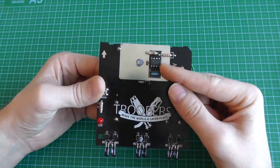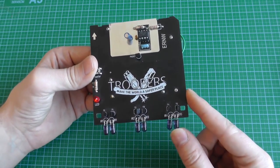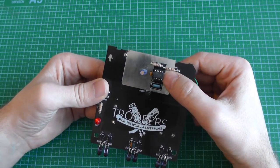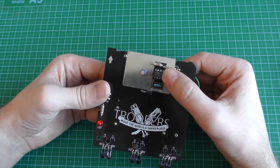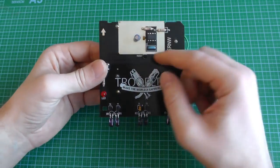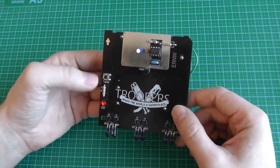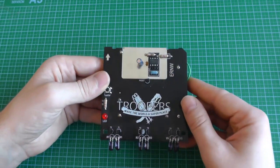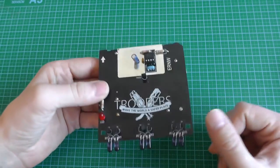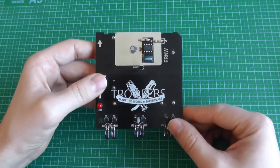The small microcontroller here cannot provide enough power for all these LEDs. I think each LED is 100 milliampere. So we have 600 milliampere. And the output current of this chip is, I think, rated at 40 milliamp. And this is why we have all these transistors to control everything, and the resistors are just for protection. So with that, I implemented the grenade using high power LEDs, but I needed to find out if it's really the right signal which is sent.